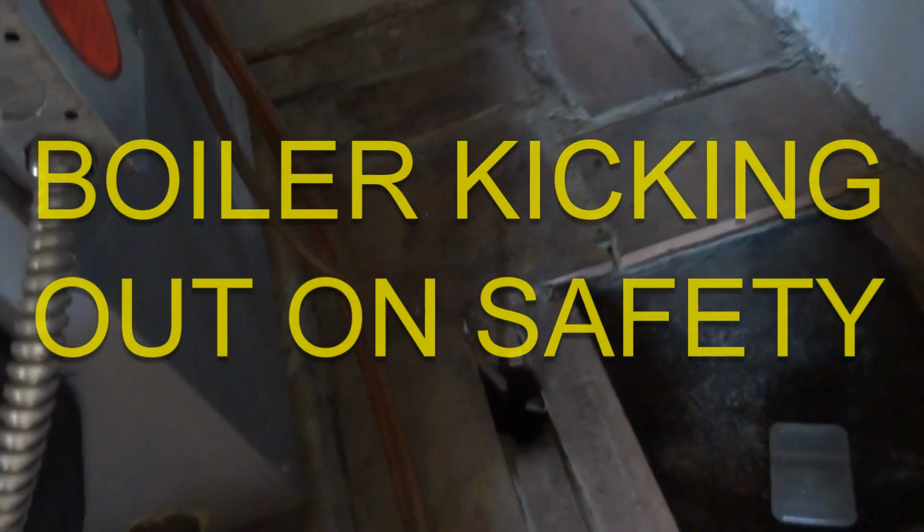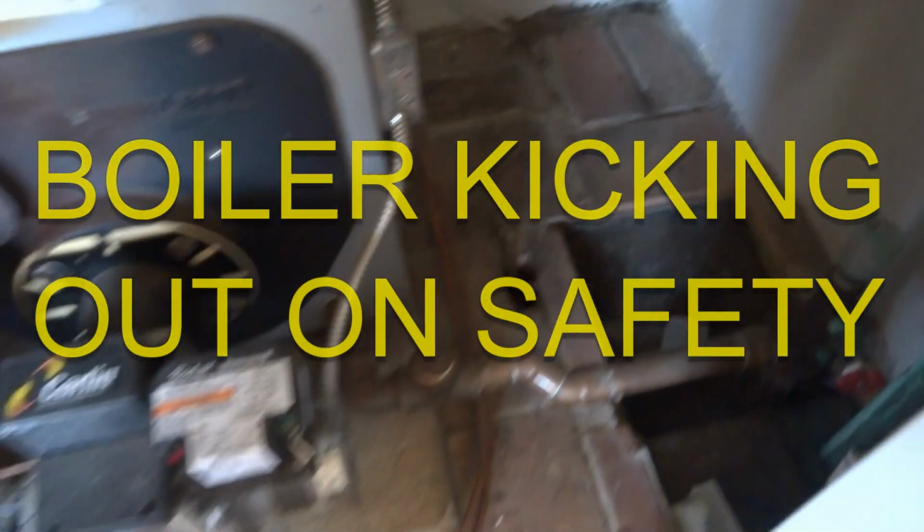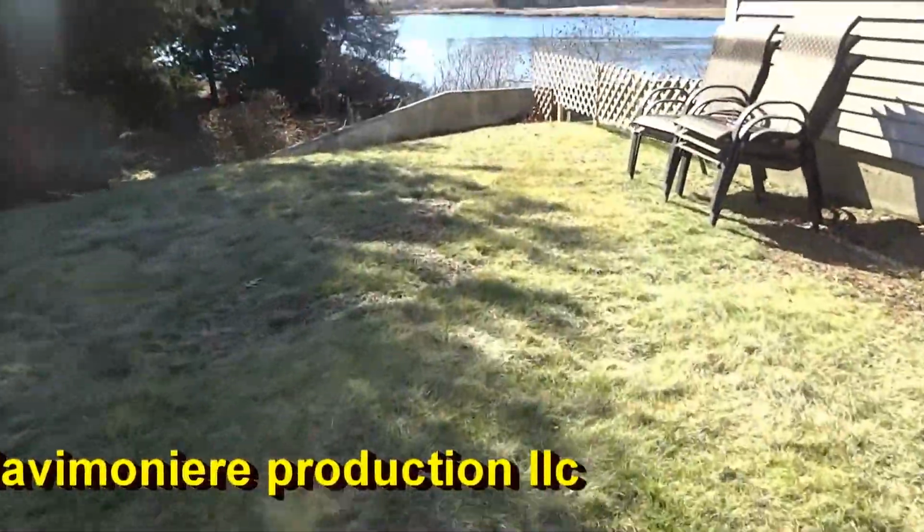It's a 2-pipe with a tiger loop, looks like. And the filter's probably in the basement. We'll do the filter first. No switch. Are you gonna shut it off? Right there. Gotta go change the filter.